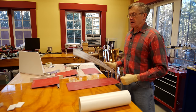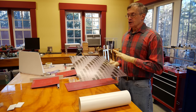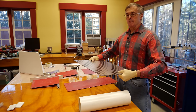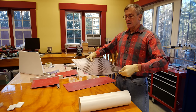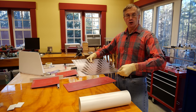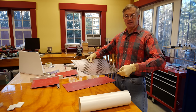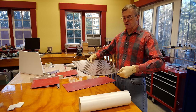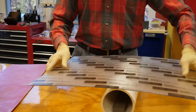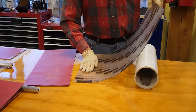This technique takes advantage of commercially available, very homogeneous thin flexible sheets. You can bend or curve these sheets in one dimension to form a very smooth, very continuous, fair curve, saving a lot of the milling and machining of jigs and supports. You can form spherical curves, parabolic curves, or as we're going to do today, hyperbolic curves.